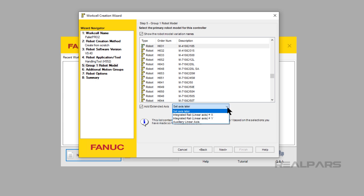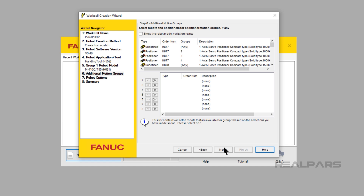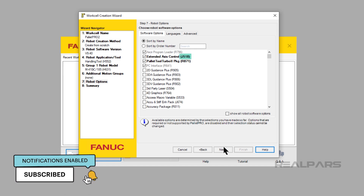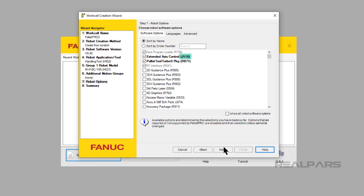Then click the drop-down and select Integrated Rail Positive Y. Now set the range of the robot. I will set the lower limit to negative 8700 millimeters and positive 8700 millimeters, which is the maximum range in RoboGuide — you may use another range depending on your use case. Click Next. We are not using any other group axes, so click Next. Notice the J518 Extended Axis Control is already selected because we set this up when we chose our robot.